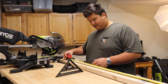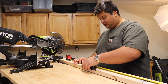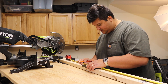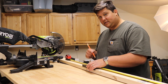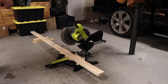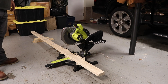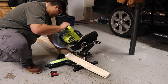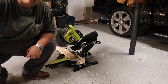We're looking for six feet here. We'll use our speed square to mark this line. Never in my life have I made a bunch of repeated cuts perfectly — but today's going to be the day. That was a lie. I've jerry-rigged a stop block over here with some bins, holding it up with a 2x4 and two 1x4s. A miter station would be nice, but this is what I've got for now. The first cut was a success, so now we just got to make a bunch more.